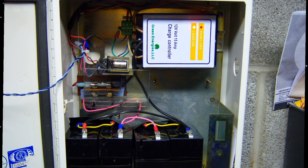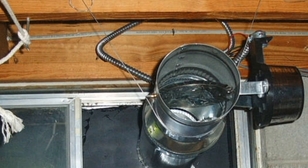This is the charge controller box I put together. It has a small 12-volt 15-amp charge controller. I had four used 6-volt AGM gel batteries in a series-parallel configuration to power the blower fan on cloudy days when the sun wasn't outputting enough. The batteries kept the fan running. I had a control panel sensor turn on the blower when the internal panel temperature reached approximately 95 degrees, and a 12-volt damper that would close when the temperature dropped, keeping cold air from migrating down the ductwork. It was ducted into a register mounted in the floor of the living room, and it kept things nice and snug in the wintertime.